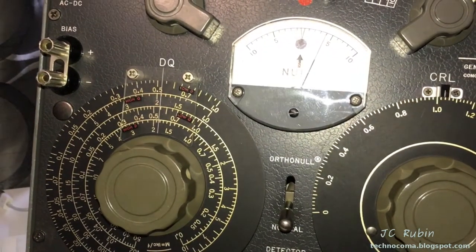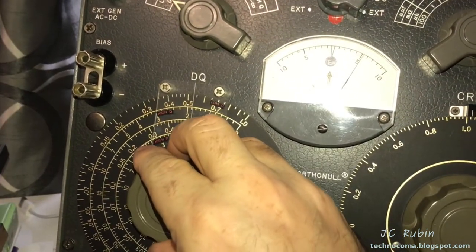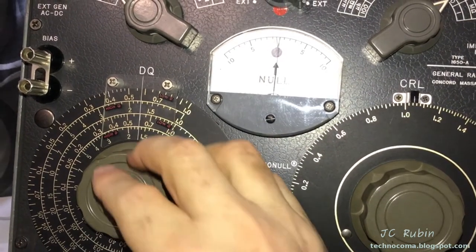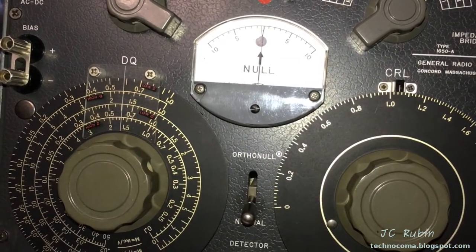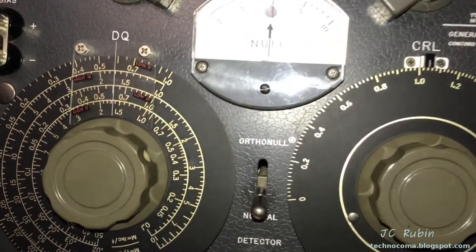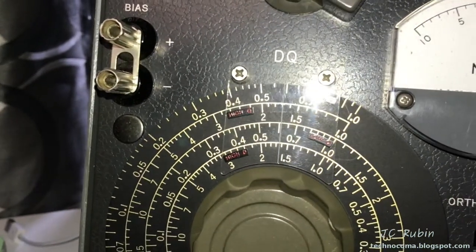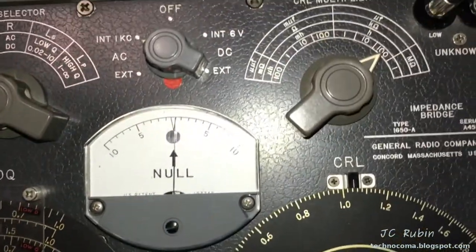The other capacitor is on now. Trying to find where it's peaking — it's slightly off from the first one but not far. We're finding it's around 103 microfarads — 102.5, we'll call it 103. Dissipation factor sits at around 0.6, so again the capacitor is showing good. We'll see what it does in the leak-down tester.